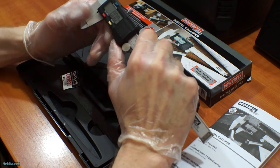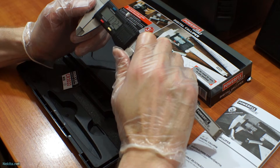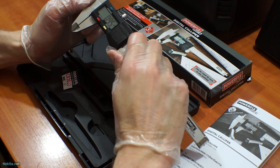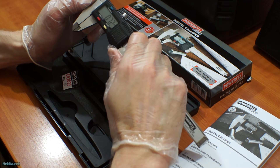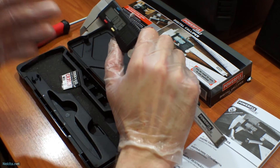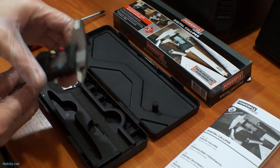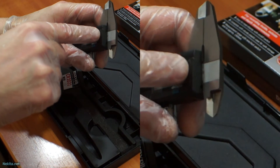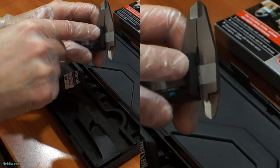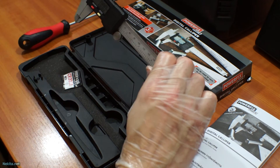So, closing it and resetting it to 0. Let's see if I can get it at the extreme point to the 0 mark on the analog readout. And in my best estimate, it's something like 0.72mm off. And if you can see that, the other line on the other side of the analog readout is completely free. So it's not even a proper analog readout if your battery runs out.